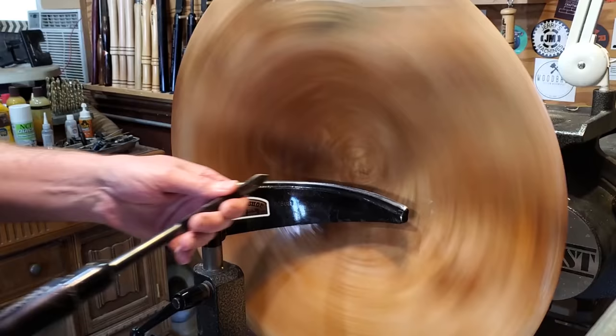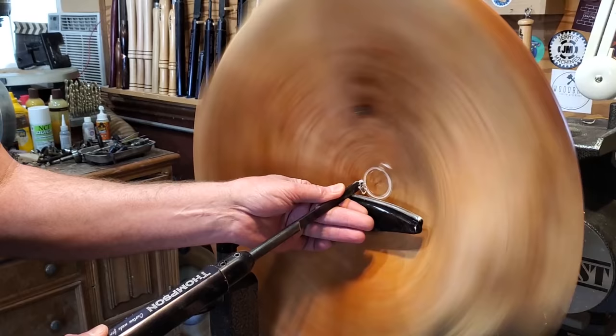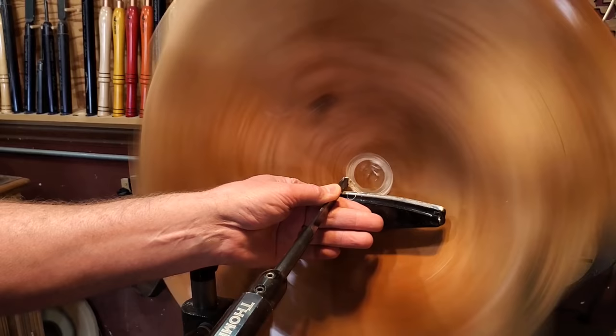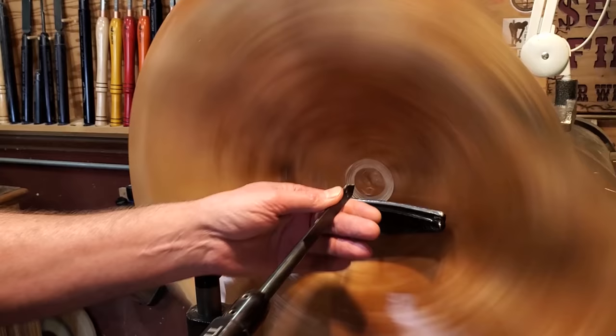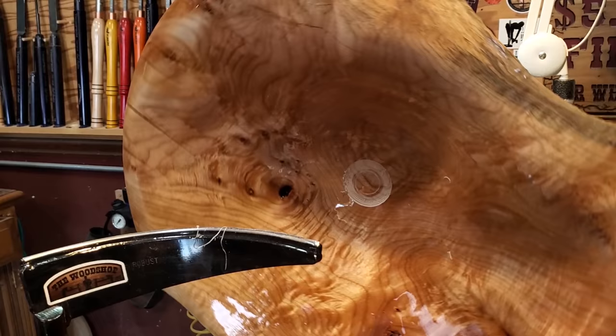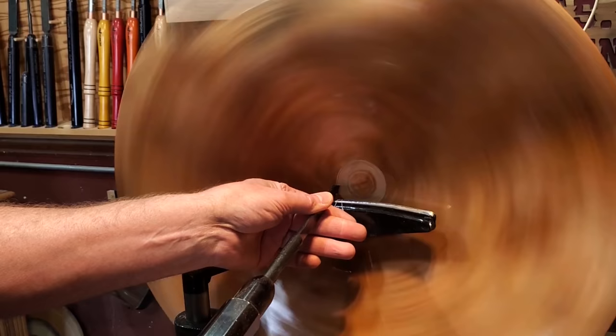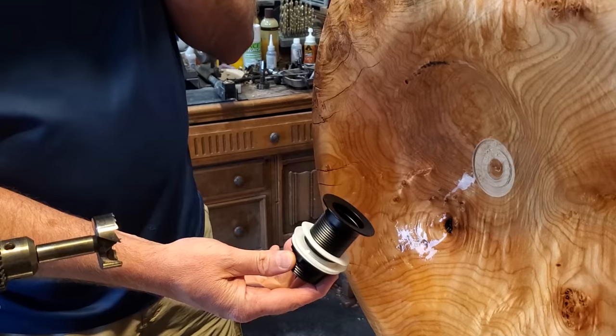I'll have a link below in the description for these drains — I use them on all of my sinks. They don't have an overflow hole in the side, which you can't have on a wooden sink, and the quality seems really good. They're about $20 on Amazon. I do the outside ring first and slowly work through it, cutting at an angle toward the drain because they're tapered. I'd recommend plumber's putty — just put a little noodle around it, smash it down, and wipe it off.